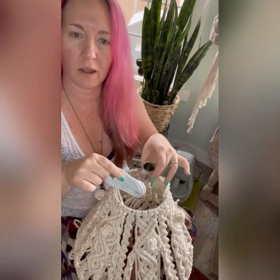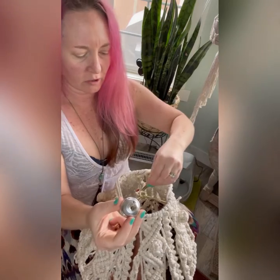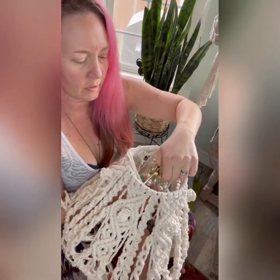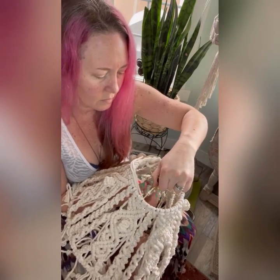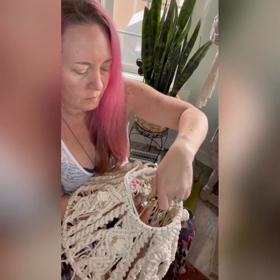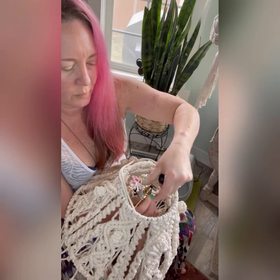This just has the wires on the end and we're gonna wire it onto this after it's attached. So you want to unscrew that little tiny screw that's on the socket, and that will allow this other piece to screw in. I actually already put this little nut on there, so I'm gonna put this through the bottom and screw that on like that. If that screw is not out enough it won't allow this to go on.